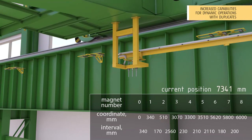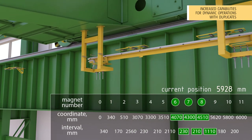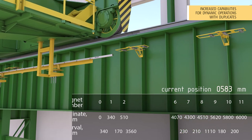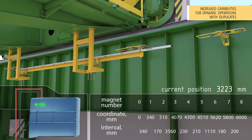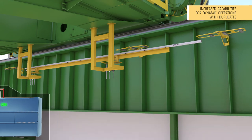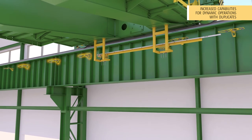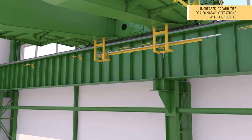The super adaptive core offers an automatic and more sophisticated solution. If any marker changes its position in space, the system just has to run over the new and previous positions of the given marker. While running over the new position, the system registers the duplicate; but once the transducer reaches the previous position of the marker, the system determines that the marker is shifted and deletes the data of the previous position, thereby eliminating the signature's duplicates in the marking. In the case of mass changes of marker positions within a positioning track segment, it's recommended to run the device over the entire magnetic marking before power is turned off, in order to clear the system of data on previous positions of the interval markers.